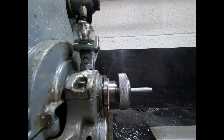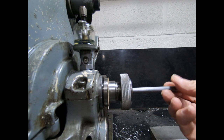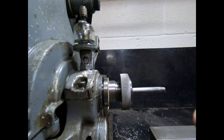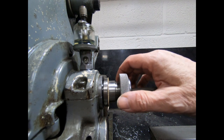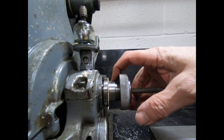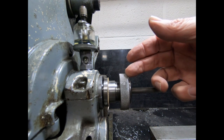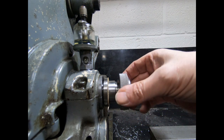You're ready to work. One of the big advantages I see of this is that a large piece of work can go through the spindle, which is quite good as opposed to the Morse Taper adapters where you need the drawbar. The second thing is you're minimizing any error - effectively all you've got is a potential error in your spindle bearings, in the quality of the Morse Taper 2 cut inside the spindle, and in your collet - so you've got three potential sources.